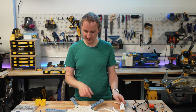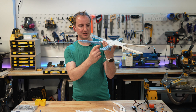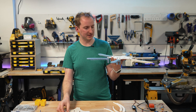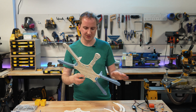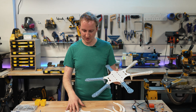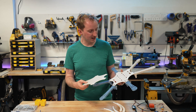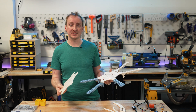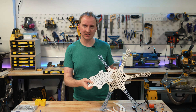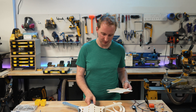I'm going to go through the physical assembly first. I've already screwed in the arms to the top section — there's a series of very long M3 screws that go through all the way from the top down through the bottom plate and then have a nut on them to secure them. The different components will either be stuck, zip tied, or in some cases I'll print a frame and screw that down. I've put a series of holes in the top and bottom, not just for weight reduction — they're also exactly spaced one centimeter apart and sized for M3 screws with a 3.4mm clearance hole, creating a grid where I can design various cages and other components to screw down easily.